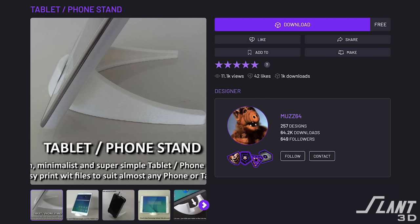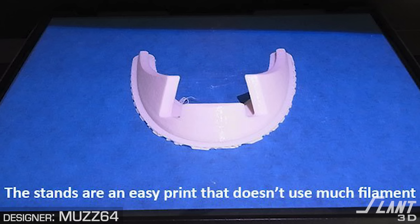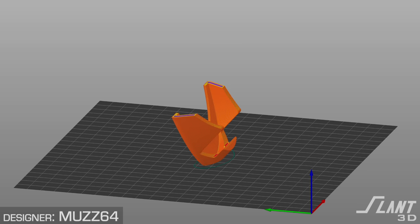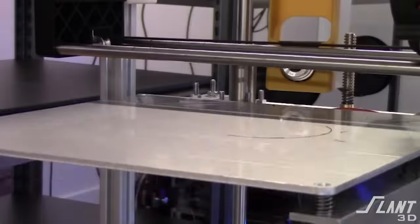Tablet/phone stand — the half-moon crescent shape. This is a great design but tough to manufacture because it has a really wide surface contact area on the print bed, so ejection is tough and that curve slows things down. If I was tweaking this, I'd figure out a way to print it up on its nose so it doesn't have such a wide contact area. For a larger tablet stand version, someone or a bot would have to come pluck it off, which is a really slow cycle time. You want the machines to be able to push parts off and move on to the next one.